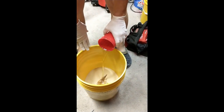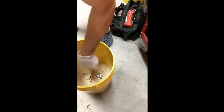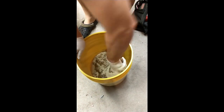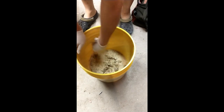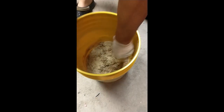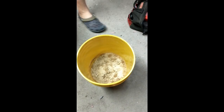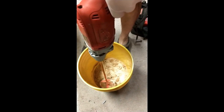We just mixed our urethane mix. We're using urethane because I need it to be strong enough to pull — with the draft being that high on some of those tools, I do a pre-mix before I put the spinner on it, because the spinner will throw all the material on the sides of the container and it just gets gummy. So you rerun it in reverse — it mixes better.